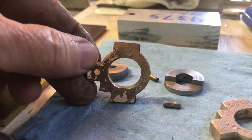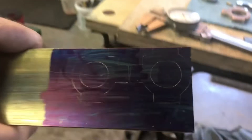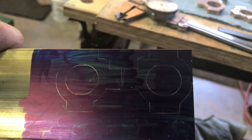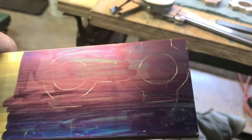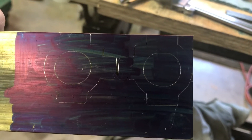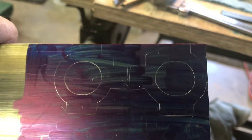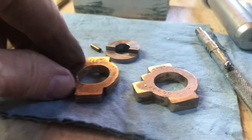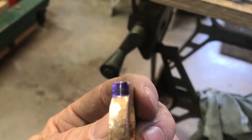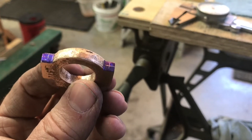I've also been working on four-jaw chuck setups for the actual machining. Because I'm having to order from England to get these parts, I thought — heaven forbid if I ruin one — I've got some 3/16ths inch brass as a possible substitute, since the finish size is 3/16ths of an inch. So I traced out the parts on the brass as a backup before I start machining. I've blued and marked them and I'm getting ready to center pop the places where the holes will be drilled.